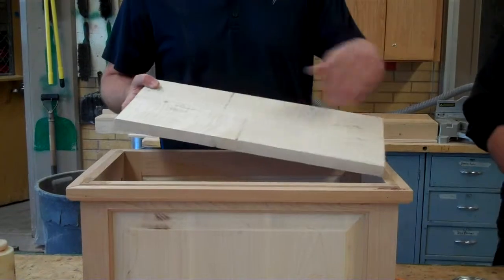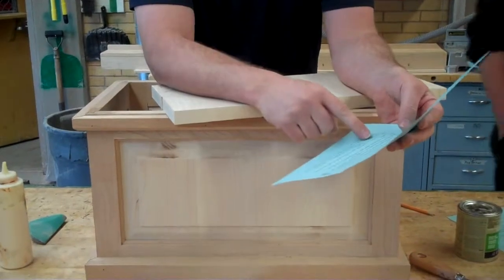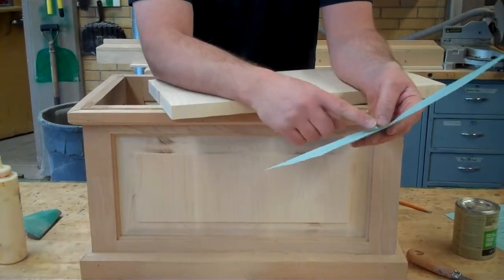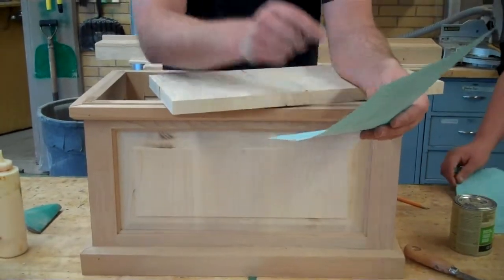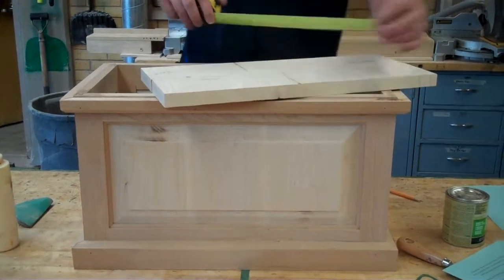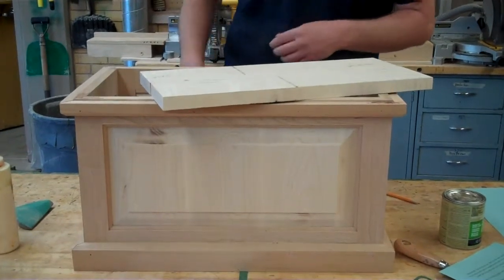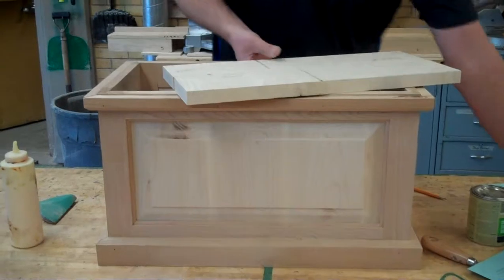You guys know how to do that. You know how to cut on the radial arm saw, the table saw and all that, and glue boards together. So all I did was, it says, get your board glued together. This is number 13 on your paper. That's more than 8 inches wide and 20 inches long. So I made sure when I glued this, I'm about 8 3/4 and I'm about 20 1/4. So as long as you're more than 8, more than 20, you're fine.